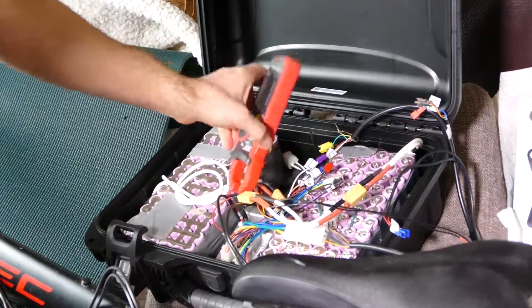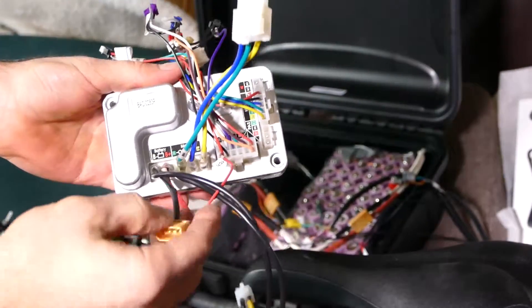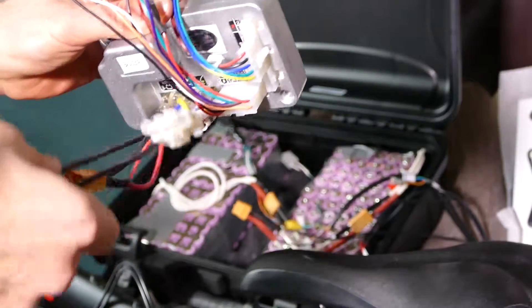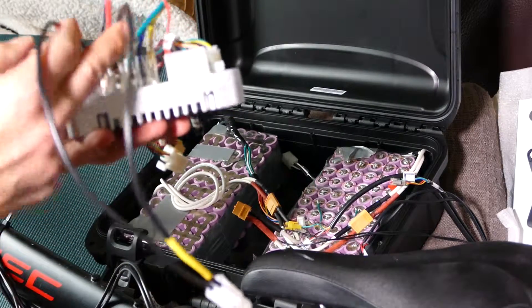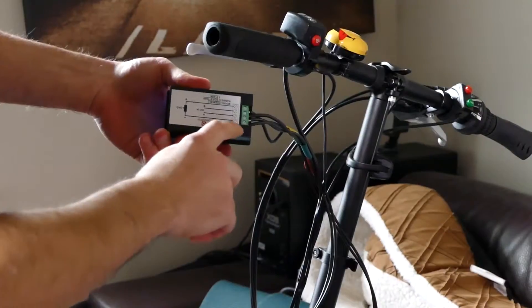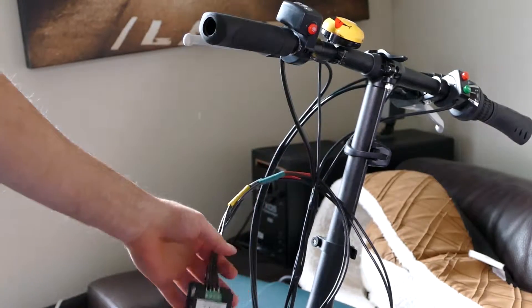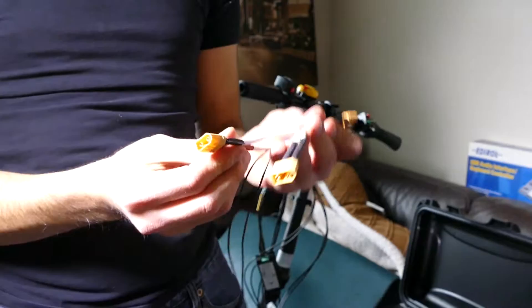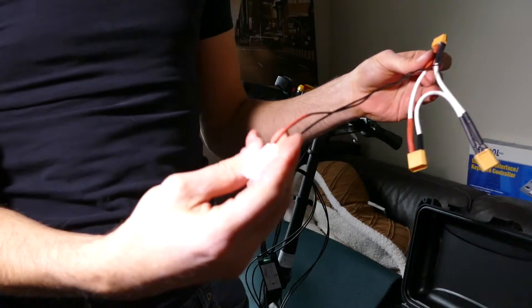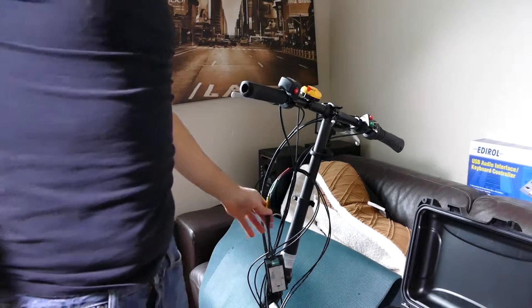Here's what I did: I ran two pairs of cable wire. Here's my controller — here is where the main power goes in, positive and negative. I spliced the wire on each side, positive and negative, and that goes back to this ammeter on the load side. The DC in is tapped off the main power feed — here's the series cable where the main 48 volts come in. I spliced in there to power this thing, but I don't understand if it's just shot.